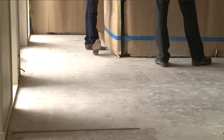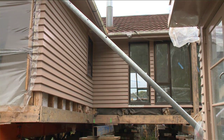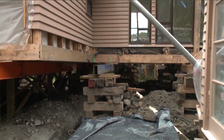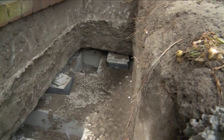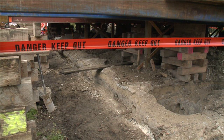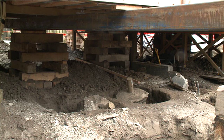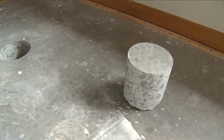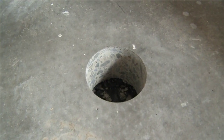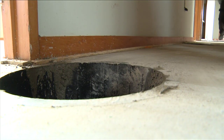With a ring foundation — whether it has a concrete slab or a timber floor — does the repair method change much? It's generally the same, except for a concrete foundation it's a little more work because you don't have as much access to the subfloor. With a timber floor on piles, there's generally a crawl space where you can physically manipulate a jack to raise the bearers and provide a level floor surface again. With a concrete floor, you don't have that crawl space, so you need to create it. In this home, they've drilled holes through the slab, poured a lifting pad at the base, and then jacked the floor and foundation off those pads to bring it back to level.